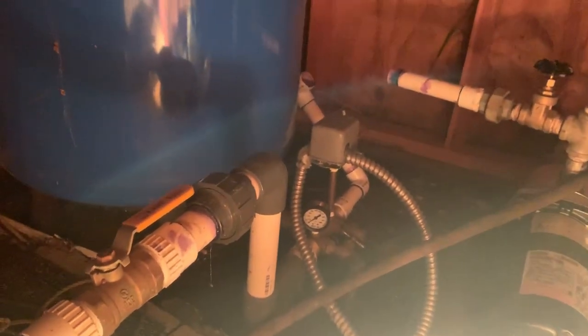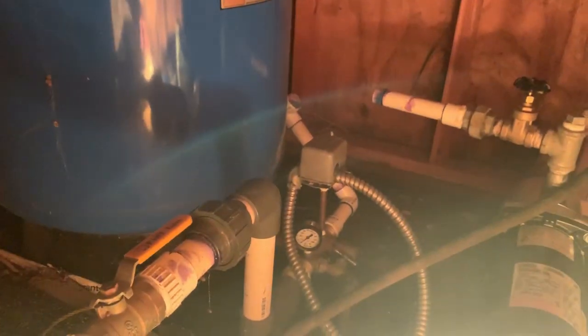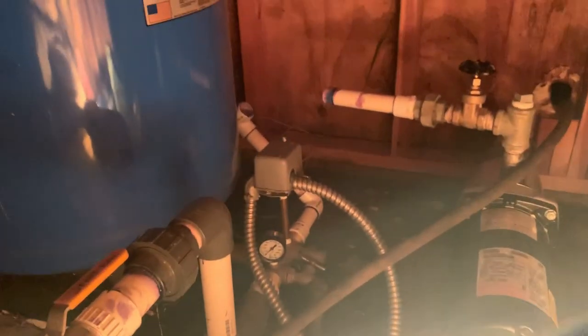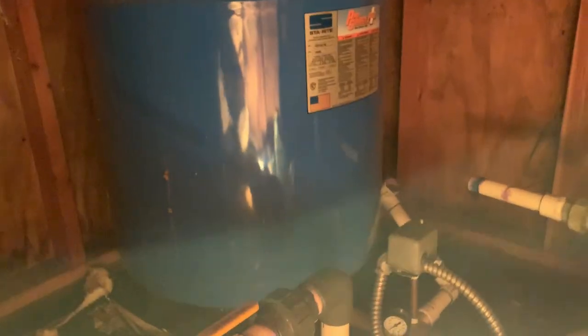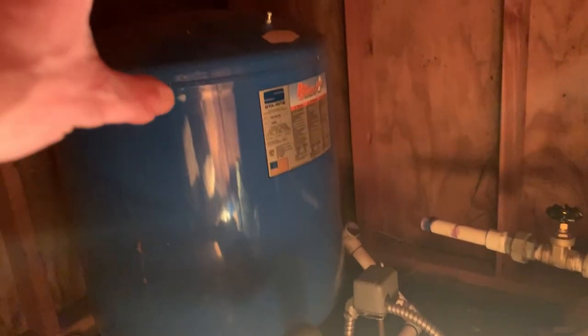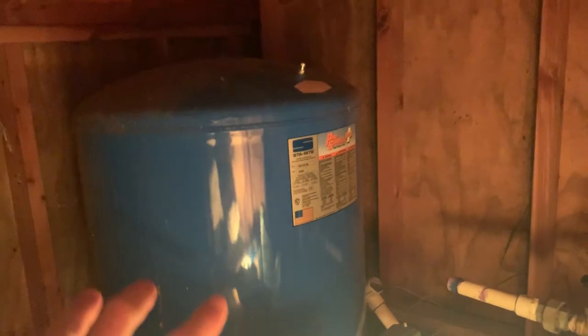The reason why it cuts off when it gets below minimum pressure is for situations like this — where if a pipe bursts, you don't want the pump to be continuously running, as that'll just wear out the pump. The reason you have the pressure tank is to even out the demand requirements. You don't want the pump cycling on and off, so if you're just going to be using a little bit of water, there is an air bladder up there — you can see there's a Schrader valve at the top for pressurizing it — and that air bladder applies pressure to the water.